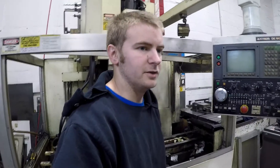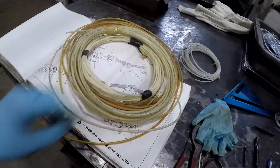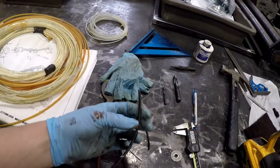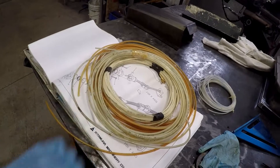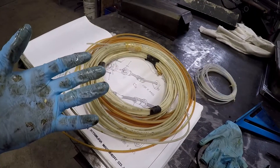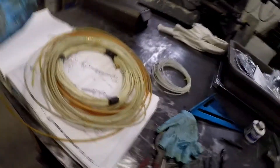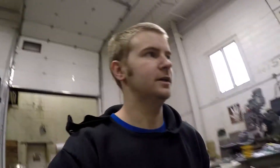I went around and tried to find some tubes we could use. Here's my stash of them - this one right here I think is the most promising, it's about 151 and these lines are 159. Thankfully there's a diagram of where all of them should go in the books. We're going to try that, basically put it back together, use it for a little while, and then once we get new gibs we'll hopefully take it all back apart and put those in and get even better. So here's the diagram.